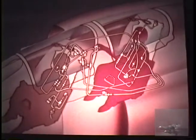A dual ejection initiated from the aft cockpit is almost exactly the same, except that the aft crew member must open the eject command selector valve. The sequence of events in a dual ejection initiated from the aft cockpit begins when the aft crew member, having opened the eject command selector valve, pulls either the face curtain handle or the secondary ejection handle. This fires the aft seat-mounted initiator, routing gas pressure through the sequencing system to the aft inertia reel, the aft canopy emergency system, and the aft cockpit equipment storage system.